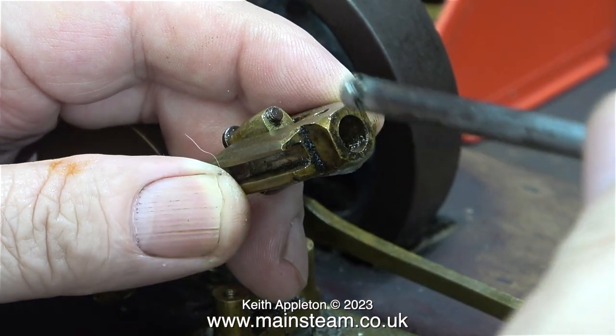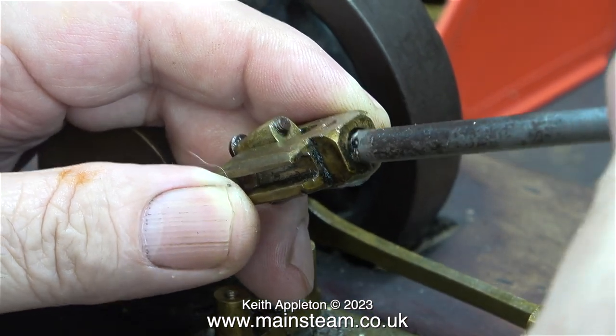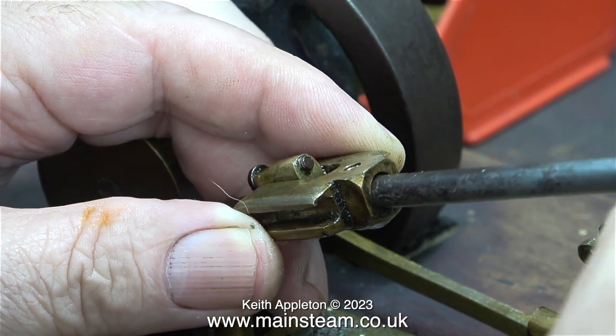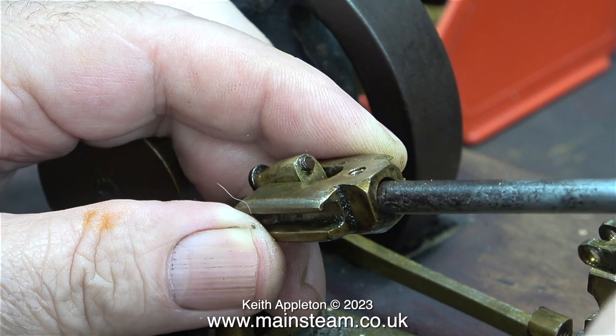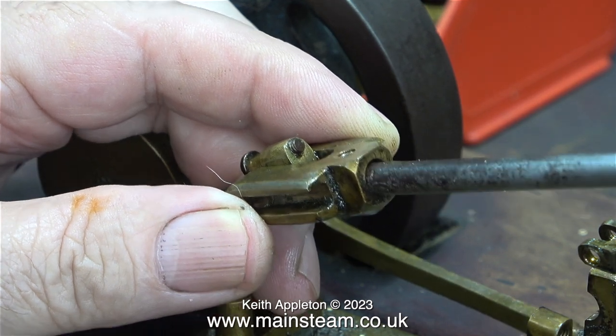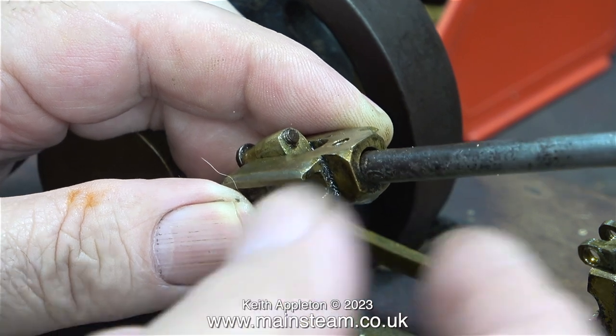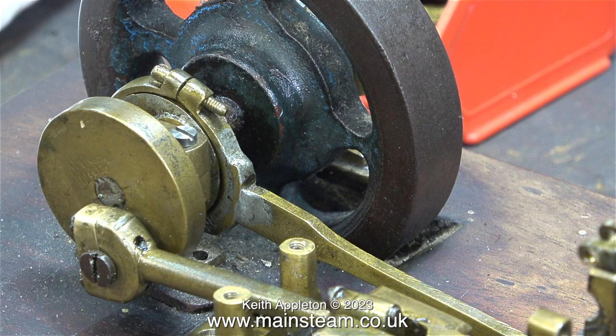And speaking of crossheads, here is the crosshead. The hole in it is not exactly the right size, so I'm thinking maybe I should machine a piston rod with a slightly larger end bit that fits in the crosshead. No, I'm having a closer look and a think about this, and I know why the hole is bigger in the crosshead. More about it in a future episode.